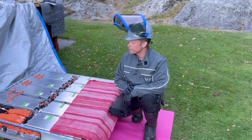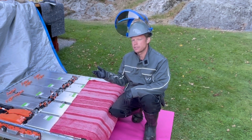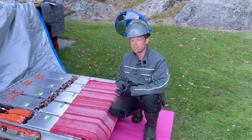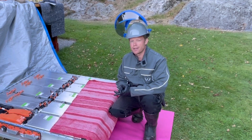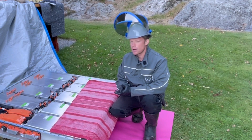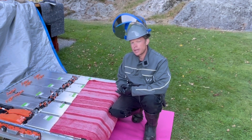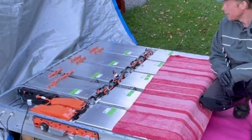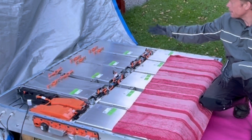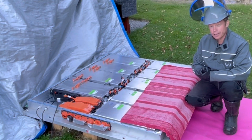I think I have cycled this battery between 3.9 to 3.55 volts maybe 20 times, and if you do that with that kind of voltage you probably don't need any balancing at all. But of course it would be great to have some kind of protection that will turn off the power to the battery if something goes wrong. Now I have to connect all the balance leads and then connect all the bus bars and screw everything together again.